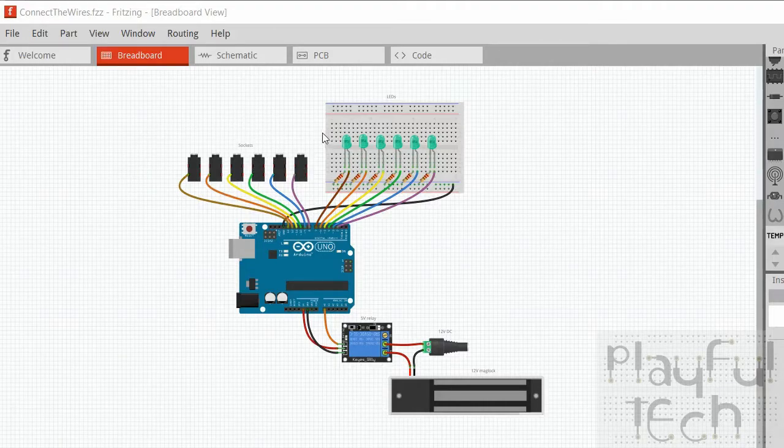For the circuit diagram I've moved the LEDs to the side for clarity. I've got a 220-ohm resistor attached to the cathode of each LED going to a common ground connector. On the output side I've got a 5-volt relay going to a 12-volt mag lock — I didn't actually have that plugged in during the video, but any of my other videos will show you how to activate a 12-volt load from your Arduino when the puzzle is solved. For a higher quality picture of this diagram, check the links in the description.